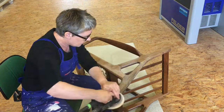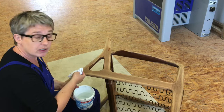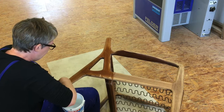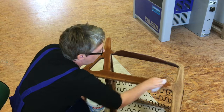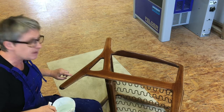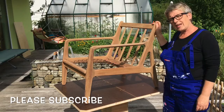I've sanded down all the large areas. Before I do any finer sanding, I'm going to put some water onto the wood - this helps me see if there's any remaining varnish I haven't removed properly. It shows everything clearly; I can see certain bits where I need to go over again. There are bits of varnish here and here, and a little bit up here, so I can sand those areas again once it's dry.